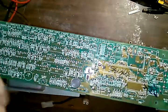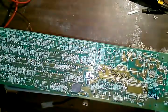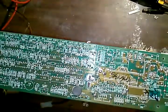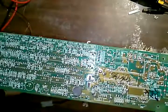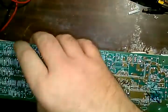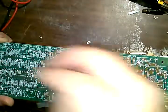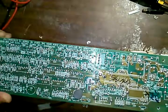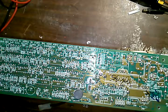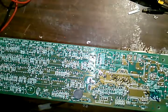With sealed batteries, just be careful. If you're going to try and rewater those batteries, be very careful. In my experience, once sealed batteries go dead, they're pretty much dead. They'll give you a false sense of success, and they may even charge up and seem to function okay. Make no mistake, though, that is a genuine false sense of success.